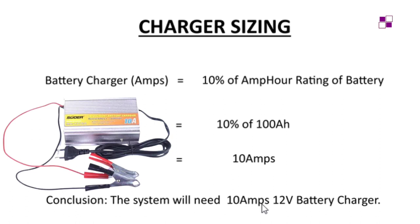If you want a system that charges faster, you can increase the amp rating of your charger. A 20A charger, which will be more expensive, will shorten the charging duration to 5 hours instead of 10. Thank you for watching — see you in the next video where I'll be showing you how to tell if your battery is good or bad.